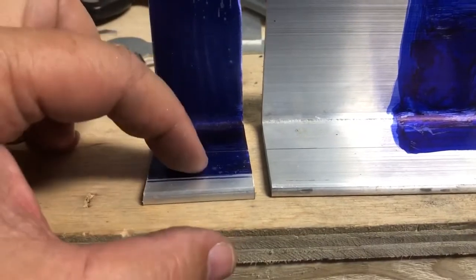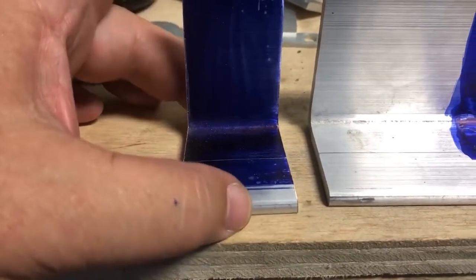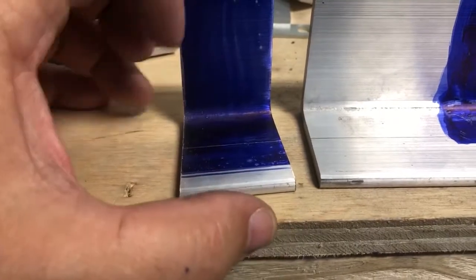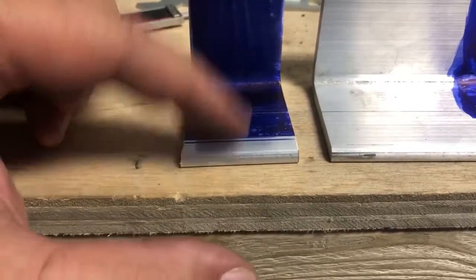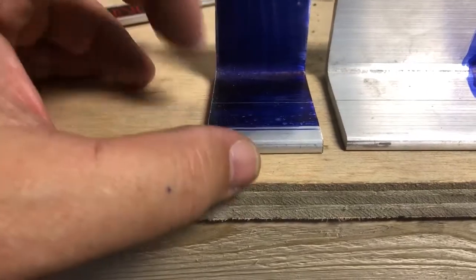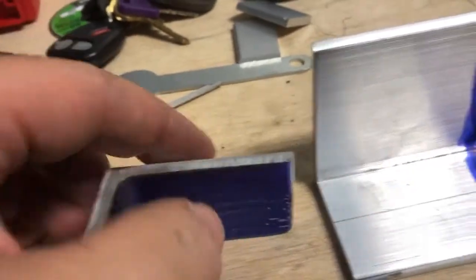This is going to be the last order of operation, because as I run this through the bandsaw, or when I cut it, it's going to give me some more working space instead of being so small. The other thing too is for the drill press, it gives me a little more working space, and this edge is a little more refined, so I can do my calculations off of this edge versus a cut edge, which, no matter how you cut it, you're always going to have some imperfections because of the wobble.